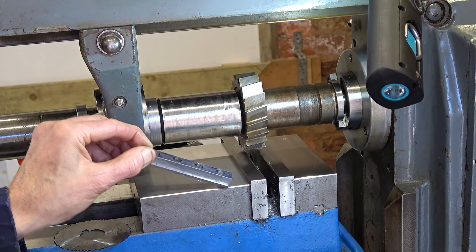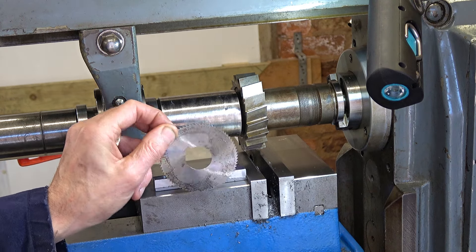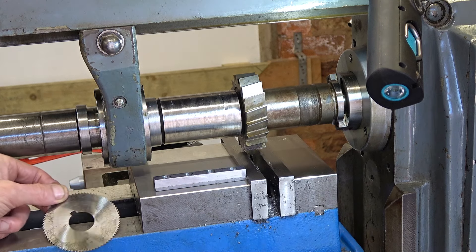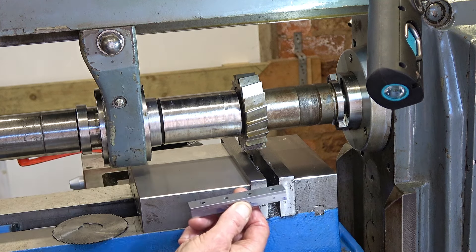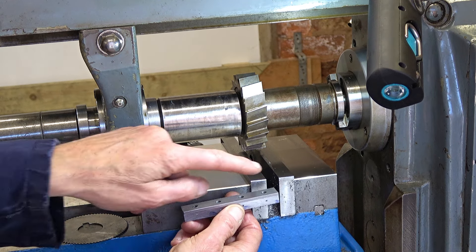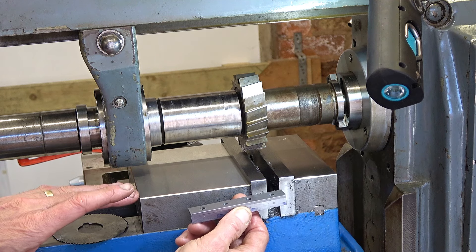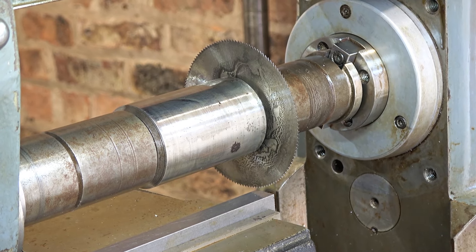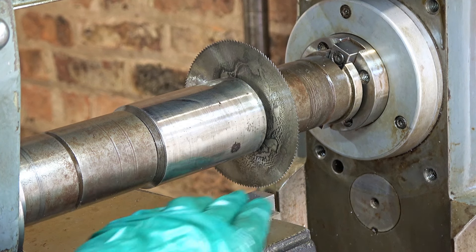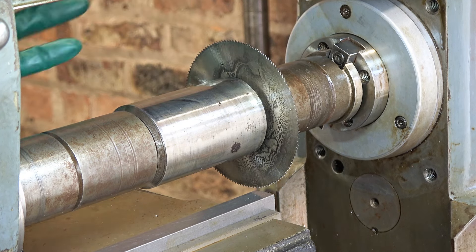To divide this into four I'm going to use a slitting saw, but I've never used one before so I'm going to do some tests first — I don't know what speed or feed I'll need. The other issue is this vice clamps this way but for slitting I need to hold the work the other way. The vice doesn't seem to have anywhere to clamp at the ends, although it does have slots for tramming keys in both directions. I'll have to set up a vice arrangement to hold it sideways. This will be my slitting saw test — just cutting a bit off the end of this 16x16 square bar. You can see how thin the blade is.